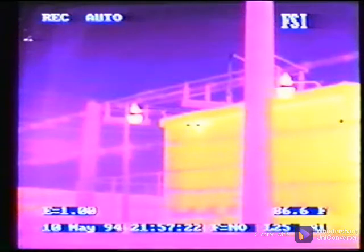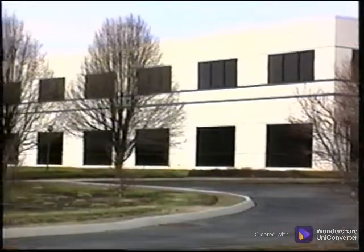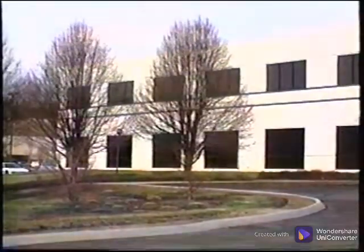The wind is another consideration that affects your temperature readings. Wind can blow the heat waves away and cause an object to appear much cooler. When scanning the exterior of a building for heat loss, wind will affect your measurements. When solar gain, reflection, or wind are present, be sure to note it well enough that another person could perform the scan and achieve the same results.